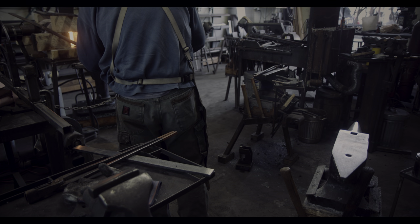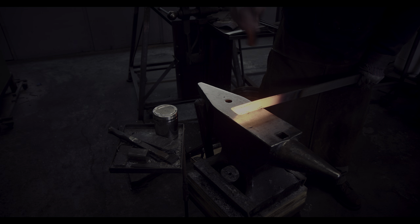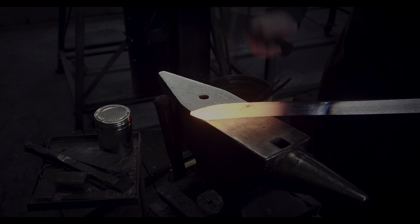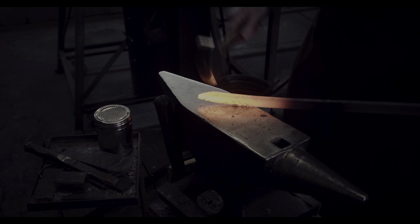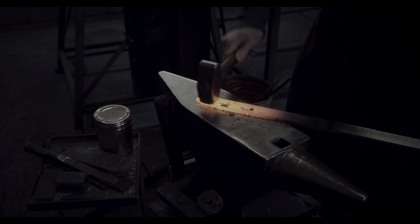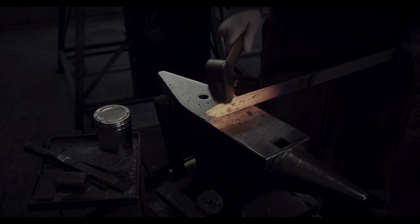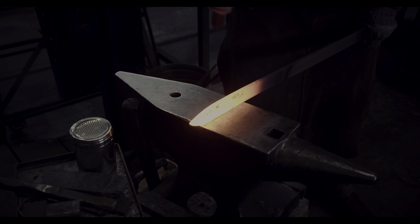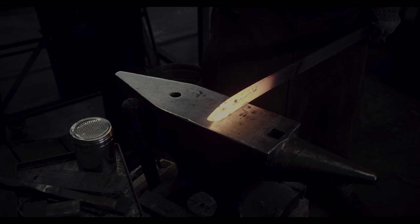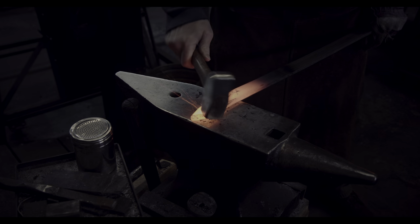Finally, it's time to forge the sword tip — déjà vu, here I come. In this particular case I am forging the tip over very lightly. The forging creates a lot of stress on the welds and I really don't want them to open back up. That said, I am quite happy since everything seems to be holding up and I seem to be back on track with this project.